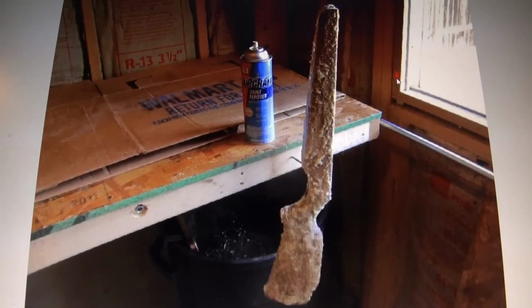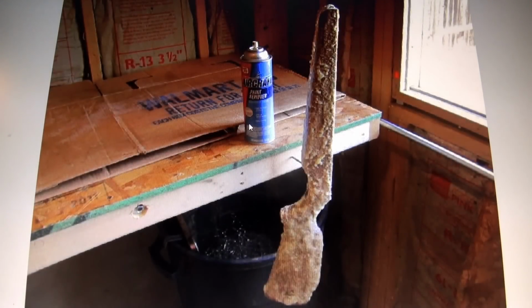So this time around, I went with the aircraft paint remover spray. Somebody suggested that that's what they used. They liked it, so I tried it. You spray it on, you wait a while, it gets the finish a little bit soft, and you can start scraping if you have a softer edge to scrape the softened finish. The finish is on there like bomb-proof, so I think I did it like 3 or 4 times, and I finally started getting somewhere with thin layer after thin layer of scraping this stuff down.